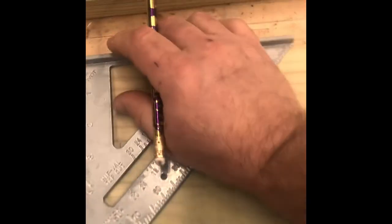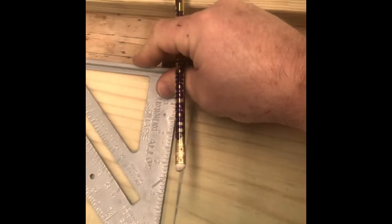If you have a regular tri-square or combination square you can use that to scribe your cross line. However, when you get to the legs — because that's a 22-and-a-half degree cut — you will need a roofing square to make that cut. Make sure you've got your fence all the way up against the edge when using the square. Now I've got my lines laid out and I'm ready to go ahead and cut this piece.